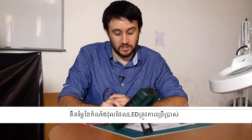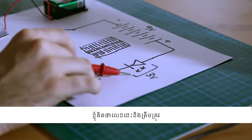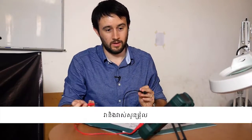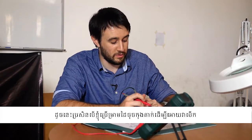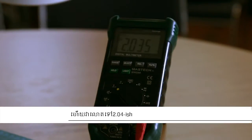The next value I drew in the circuit is the voltage that the LED was going to use. I told you there would be roughly three volts across the LED from the top leg positive to the bottom leg negative — I'm expecting this number to be a fair way off. Again, turning to DC volts, it reads zero because the circuit is open and the switch hasn't been closed. The voltage across it is only millivolts. Now if I press my finger on the switch and measure again, that number jumps to about 2.04 volts — about two volts.